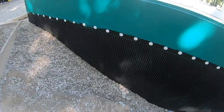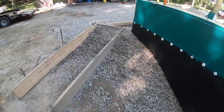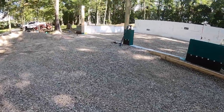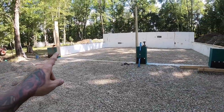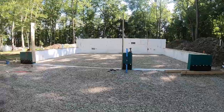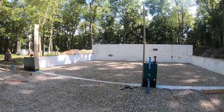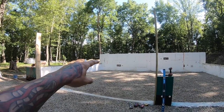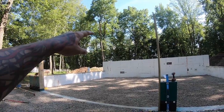It's all washing off because it's all waterproofed anyway. This right here will keep the concrete in there so when we pour it it's not going to go anywhere. We're going to finish off these last nine-footers. The garage doors have a rough opening of 18 feet wide and nine feet tall - these things are huge, they're massive. On top of the sill plate we are going to have roughly a 12-foot stud going all the way up to where the top sill plate is going to be. I plan on only using two pieces of OSB for the outside sheathing.